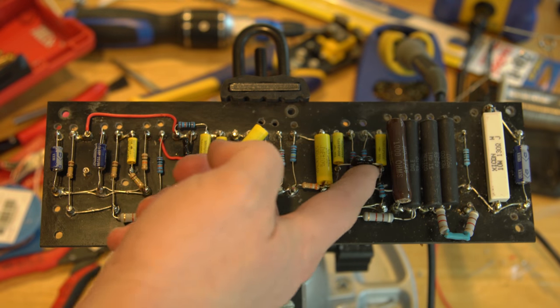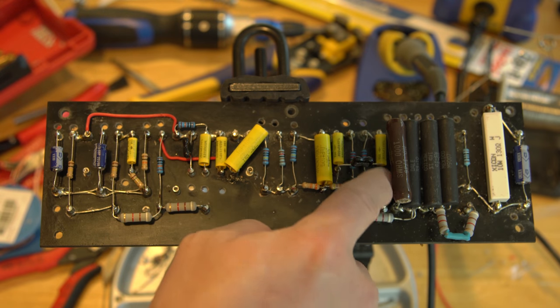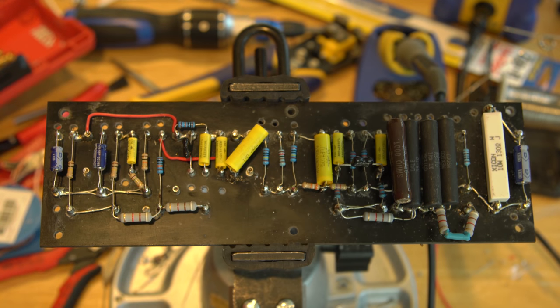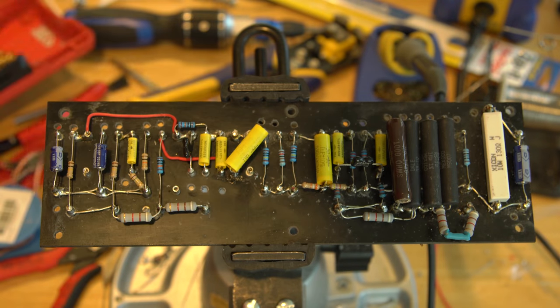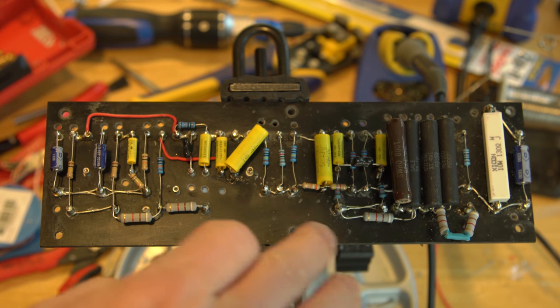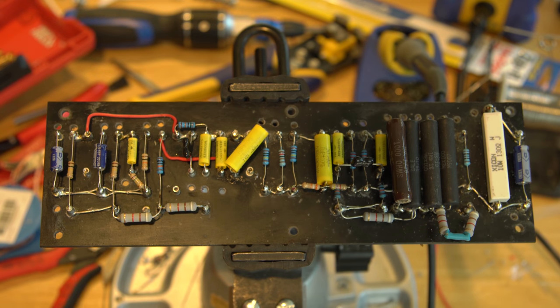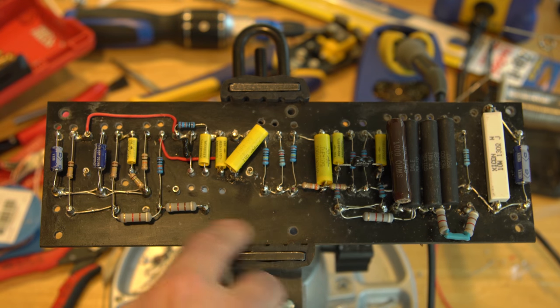I also forgot that I needed to put a coupling capacitor — it actually joins between the 200-ohm resistors that come into these, before connecting into the 220 to ground. On the schematic that is this 100 picofarad that connects between those two. You can review this schematic if you're following along. I'm also going to be most likely replacing this one — somebody is sending me some that are actually the 25-watt ones that the schematic actually calls out for.